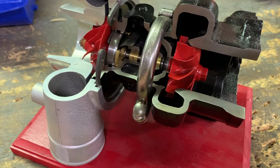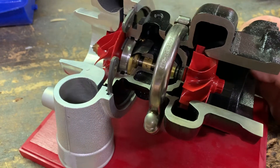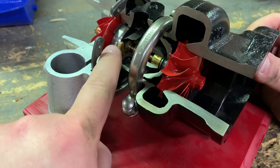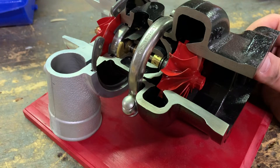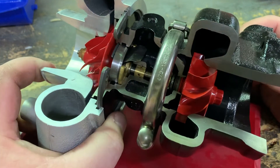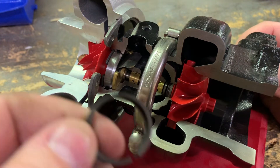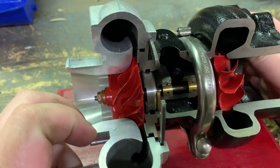If you've seen other videos on my channel, you've probably seen this cutaway model before. Let's take a look in here. First thing — journal bearings. Let's identify the journal bearings in this turbo. You can see they sit there, and the other one sits there. Then you can see the thrust bearing here — this one is not a 360-degree thrust bearing; it appears to be a 270-degree thrust bearing. You can see the seal rings right through there. And the snap clips hold the bearings in place so they're not sliding back and forth on the shaft.